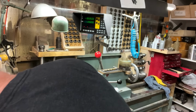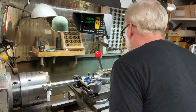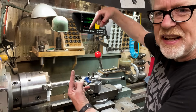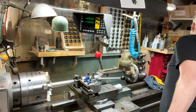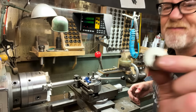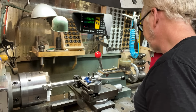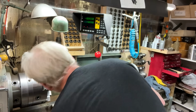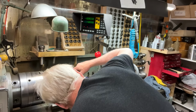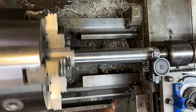And Z, yeah, we're at Z. Yeah, that's already as slow as we go. Now, I like the clamp knurler better than any other kind of knurler. That's what this is here. It clamps from both sides. Normally, it involves pressing a hardened wheel right into the work, which puts a lot of stress on that, and I don't like to do that, so I'm not going to. This, I mean, I can rebuild this at some point. It will be better someday. Oh, this is going to take a while.